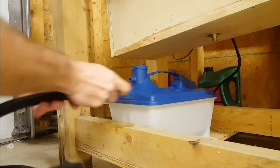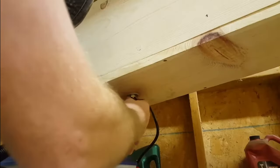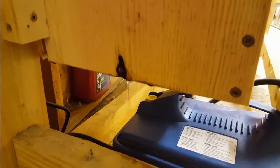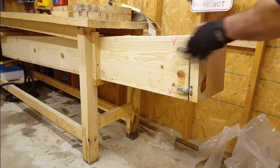Just remember to place the inlet somewhere near the back of the box, because steam rises and it will rise towards the front. Once you connect all the hoses, the box is basically done. The only thing I didn't show here was drilling a hole in the back of the steam box to allow water to drip out, because you're going to end up with a ton of condensation inside and you want a way for that water to release — otherwise you'll end up with a pool of water in the back.